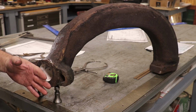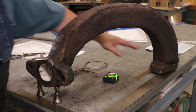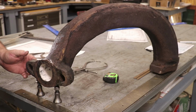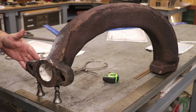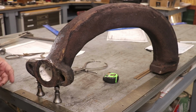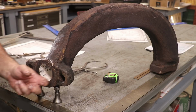This end down here was the end that was on the bottom in the locomotive, the bottom pieces. This was the top piece up here. I've got it sitting on the table this way because I've been making some measurements, and this just seems to be a good way to position it to get the measurements off of. But the biggest problem we have with this thing is all on this end, this bottom end of the casting. And as you saw, we were getting a pretty bad steam leak around the bottom here.